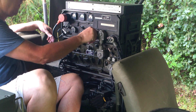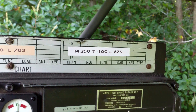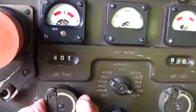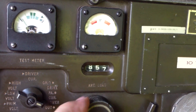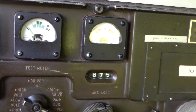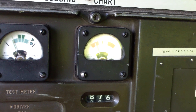Now that we've found an open channel, go ahead and turn the amplifier on. We'll look at the presets for 20 meters, which is tune 400 and load 875. So we'll set the tune to 400 and the load to 875. Then after we have the tune and load set, we'll go down and put the amplifier into tune mode. The amplifier will come on and by using the tune and load controls, you center both tune and load.